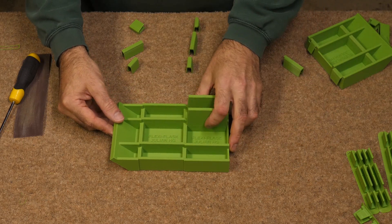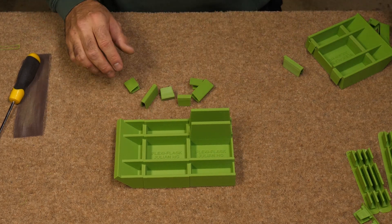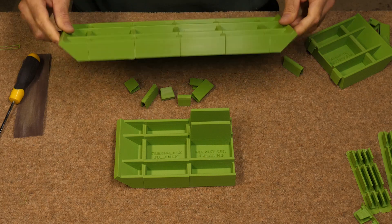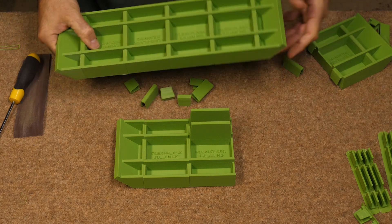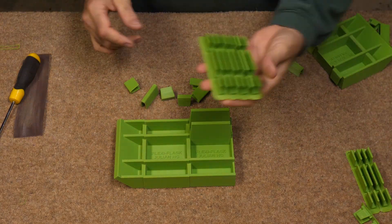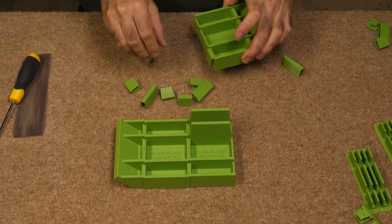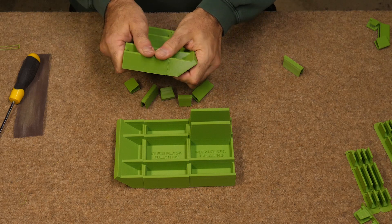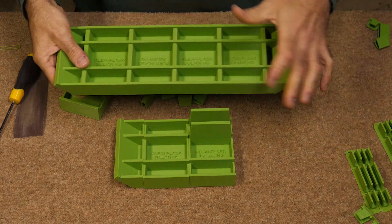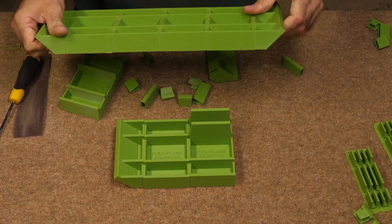I first designed them to be glued together, and it was an afterthought to add the clips to make them reusable. But I think the potential for being able to reuse them — and thus reduce printing time and gain sheer flexibility — could be so good that it's worth investigating that side of things first. Fresh off the printer, they all clip together surprisingly well; these 3D printed clips seem pretty good. They can be broken down again quite easily and seem to go back together well enough, but we'll see when it comes to casting. Also, these parts might not be accurate enough when joining the four flask sides together — the more sub-parts you use, the more inaccurate that side will be. But only trying them out will answer that.